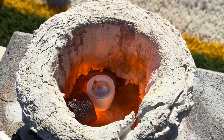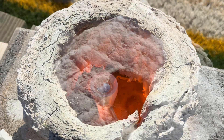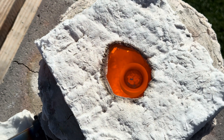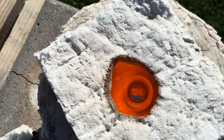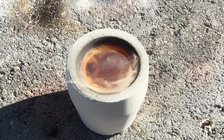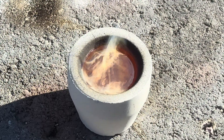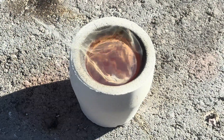We got this up to about 2,000 degrees before it even began to melt. There has to be some other type of metal within this material because every time I blow a little bit of oxygen onto it, it just hardens up. We're not getting any type of oxidation on this material, so there's no way for the cupel to absorb any of the lead oxide.